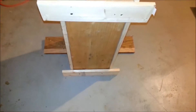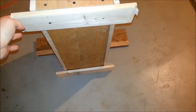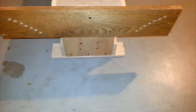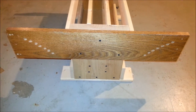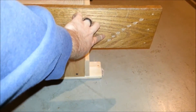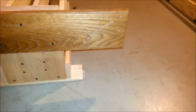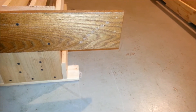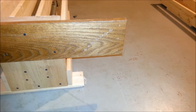I put 1x4 leggings on it — they stick out approximately 2.5 to 3 inches off of each side. Then on the ends I put 27-inch 1x6s. I drilled holes where the center of each hole is 3/4 of an inch apart. They are 5/16th holes drilled in, which accommodates the bolt and wing nut to adjust your angle.